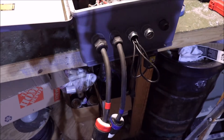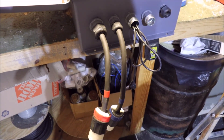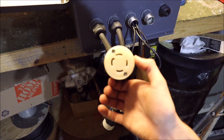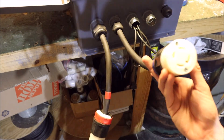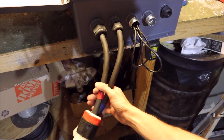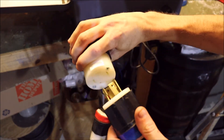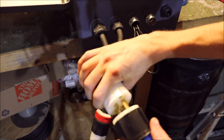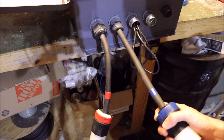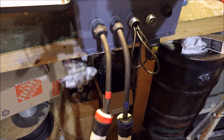That's pretty much a general description as far as wiring goes. I've got it pretty simple right now — I actually went over to Home Depot and rewired it just to make it quick-connectable. I got some of these big 4-hole 240-volt rated connectors — I think these are rated for 30 amps. This is currently what I have controlling the light. I have them blue with blue, red with red — they just plug in and lock. And that's it — then it's ready to go. That's pretty much everything as far as how it works and general operation. That's the boring stuff out of the way — let's go ahead and get started with the fun stuff. Let's turn this sucker on.